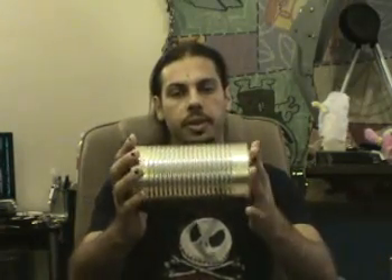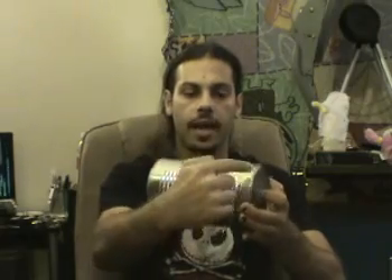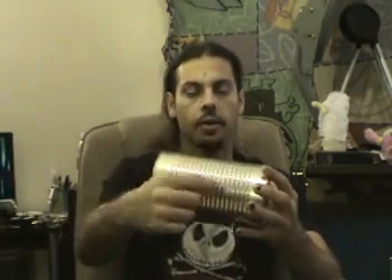The reason it's called a waveguide is because when you have a can, a tube, or even coax, electrically it is a conduit for RF signals. That radio signal is going to actually bounce up and down inside of this metal tube, reflecting up and down until it finally gets to a driven element — some kind of receiving or transceiving element.